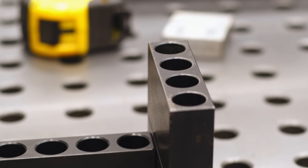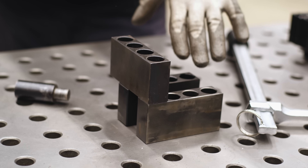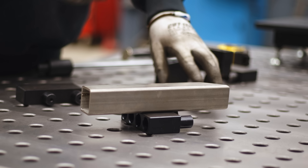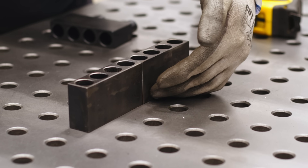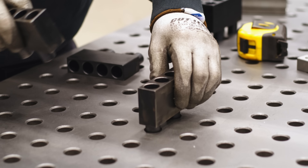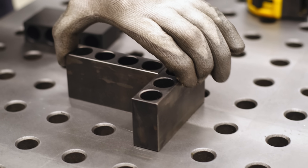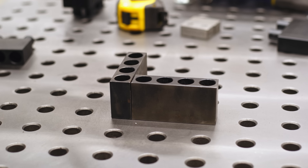These holes in the top are for clamps, so if you need a little bit longer riser you can go on top of it. You can bridge-lock them together — that's a pretty good fence too. You can build a lot of stuff just like Legos. If you need to put them on a vertical surface you can remove the pin on one side, put them in and bolt them into place so they don't fall out. They can also be used as a shim block to elevate your work. You can arrange fence blocks into a whole bunch of cool configurations: a big long row, a continuous line or fence, 90-degree corners, a T, an inside corner. You can back one fence up with another so if you need to clamp it, it won't bend backwards. This requires no ball-lock bolts — they're really cheap and very fast. By arranging these in many configurations you're able to set fixtures up very quickly.